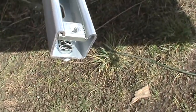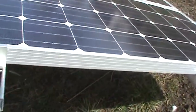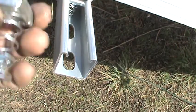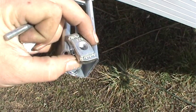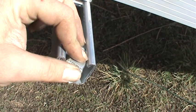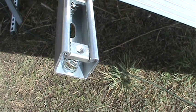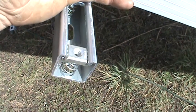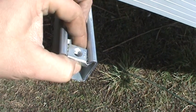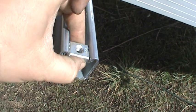And that's how I've got mine installed in there. So I hope I can help people out that are using their spring nuts. That's the way you do it - you stick them in, turn them where you want to put them, and then it holds it there. When you put your bolt or item on, you don't have to hold onto this - it'll lock itself in place. I can't turn it back that way, but once it pulls, it'll lock right in there and it won't come out.